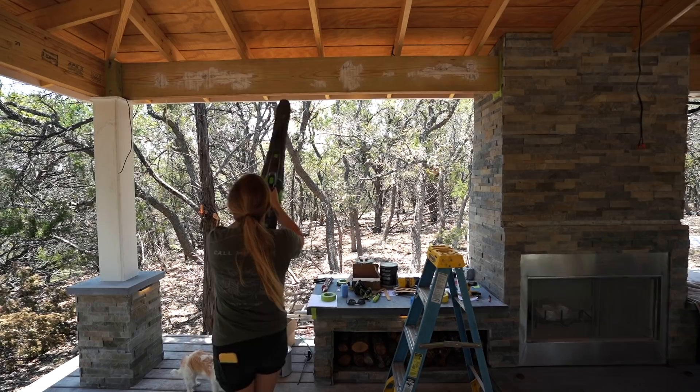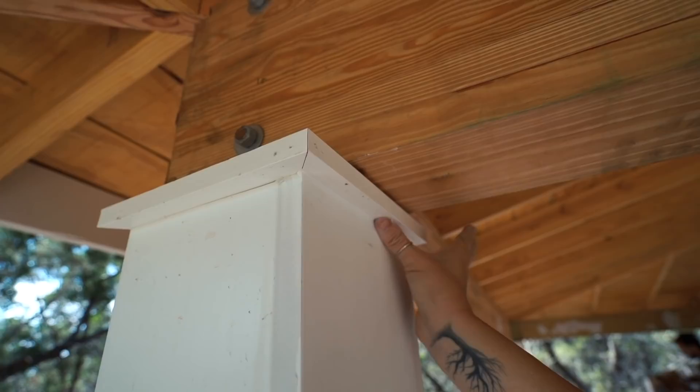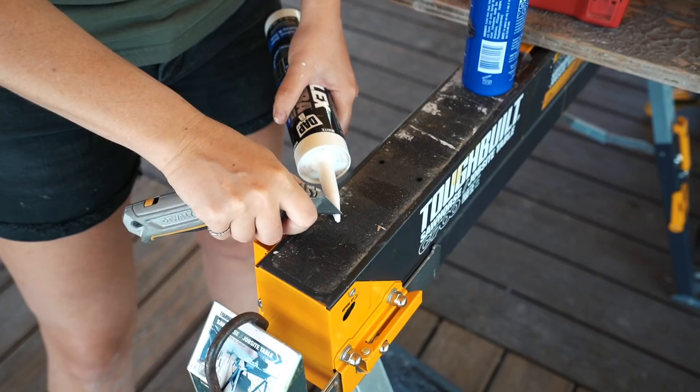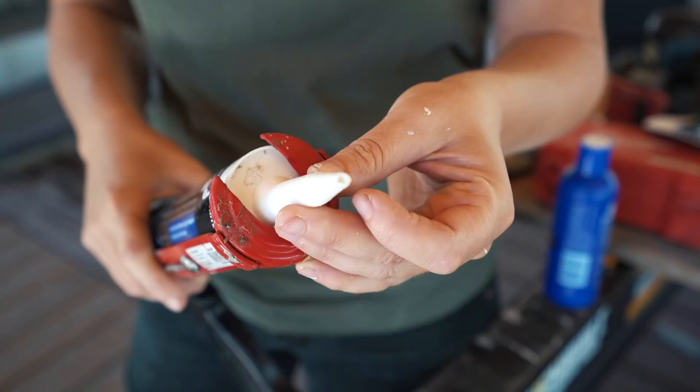Getting rid of dust and grit allows your painter's tape and your paint to adhere better. I've had my Greenworks blower on hand for this entire project, so I used that to blast away the dust, then follow it up with a brush or rag. Caulk everything, even the smallest gaps. Gaps shrink and swell with changes in temperature and humidity — paint does not handle this movement and will eventually crack, letting in moisture and leading to peeling paint. The two things that matter most in sealant are strong adhesive and long-term flexibility. DAP Dynaflex Ultra is excellent for both, plus it's paint-ready in about an hour. The big tip here is to cut the smallest hole possible when caulking — you'll save yourself so much waste and extra cleanup.